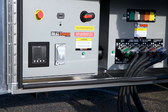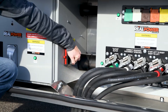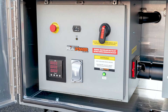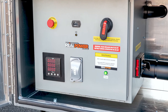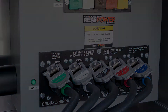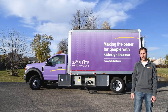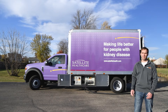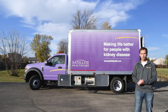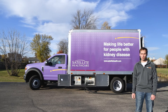Now that the system is running, hit the main disconnect and turn the selector switch to 208 volts. Obviously if you're using 480 volts you'll set it for 480. With those two levers set, you'll see power at the meter and a green indicator light turned on next to the correct connection panel. This vehicle is capable of producing about 75 amps of 480 volt power or about 150 amps of 208 volt power.